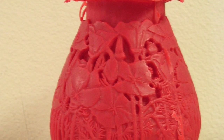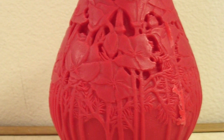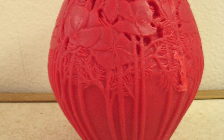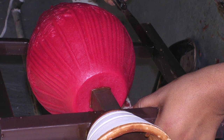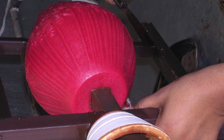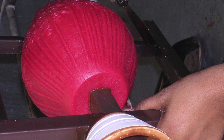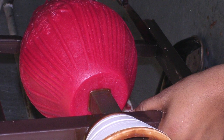Here we see the undressed wax as it appears immediately after being released from the mold, so you can see the amount of work needing to be done. Once the wax is cleaned, gates or sprues are methodically attached to allow for proper flow of the molten bronze, and a pouring cup is attached to one of these gates as an entry point for the bronze.